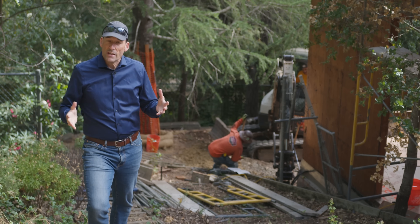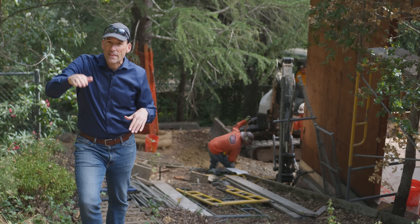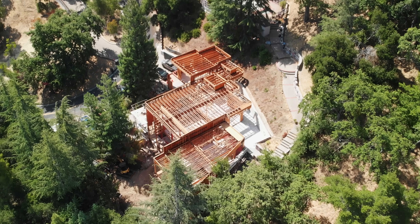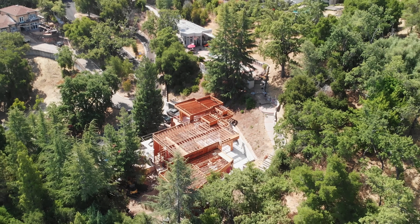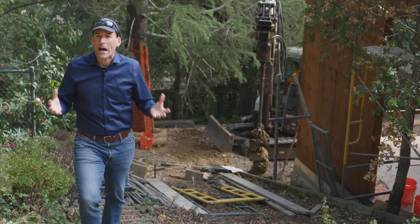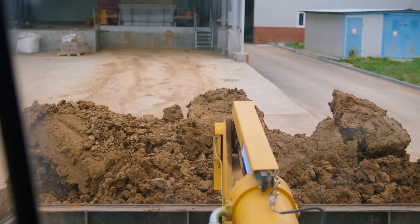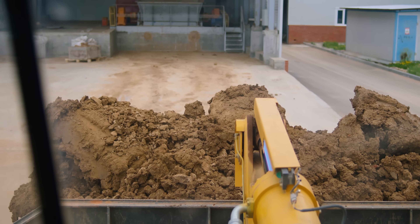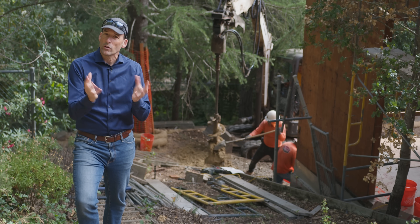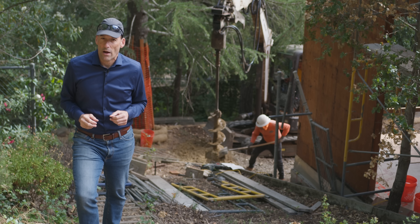An alternate choice is to build into the hillside where you have enough rock that you can actually set the house down inside the ground but on the rock. In the Bay Area it's really hard to do that, mainly because most of the soil here is highly expansive clay. That clay expands when it gets wet and shrinks when it dries, so any soil around the house will expand and contract with water, causing the house to move.